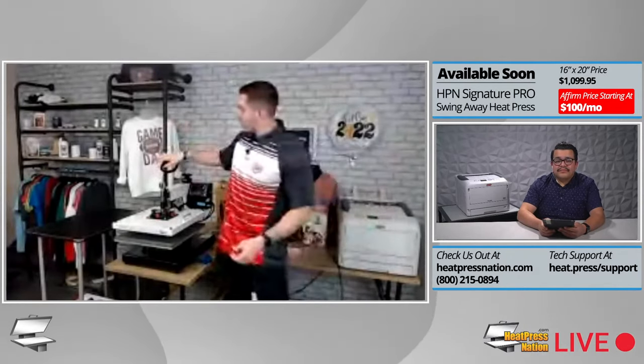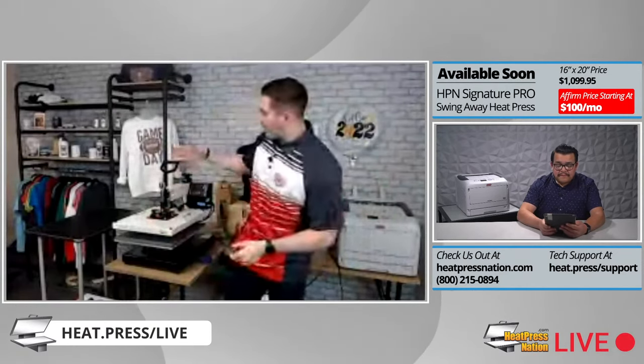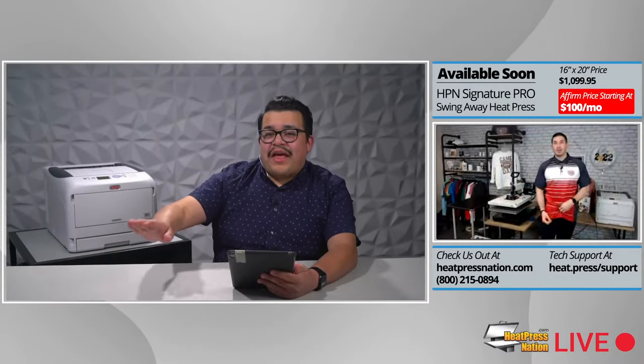So obviously with a nice quality HBN series swing away heat press, or any of the swing away heat presses, we're going to guarantee that we're going to have consistent pressure and then consistent heat. Especially when we're doing the marrying process and adding that adhesive, I want to make sure I have the same amount of pressure in the front as the back, so I'm not missing any fine details and I'm getting all my adhesive to stick where it should. So I do want to point out that this heat press or any heat press, when you are investing in a white toner printer, is going to be just as important. Could not have said it better.